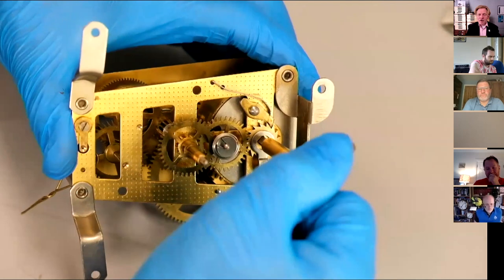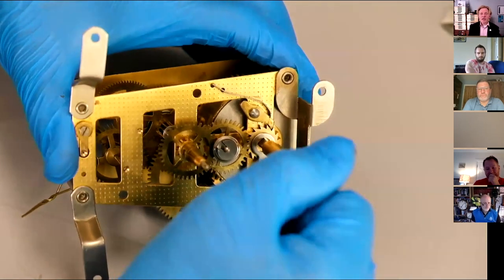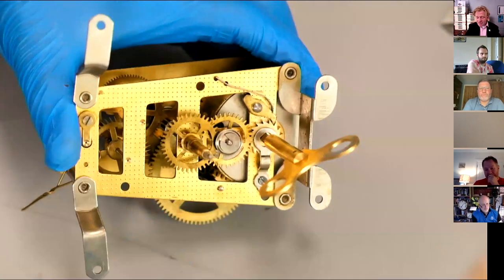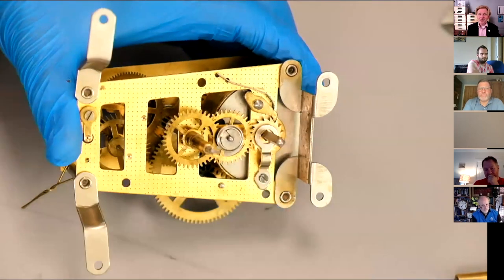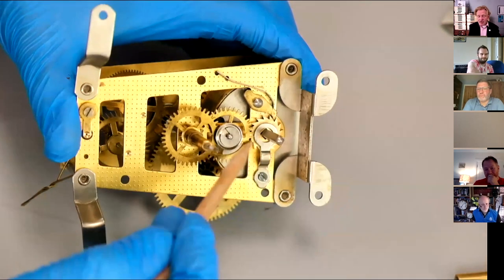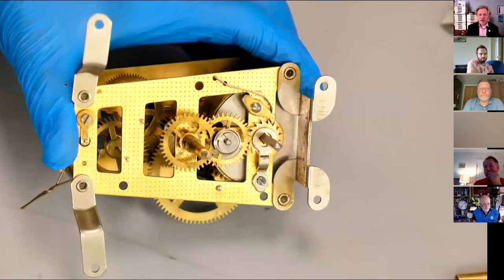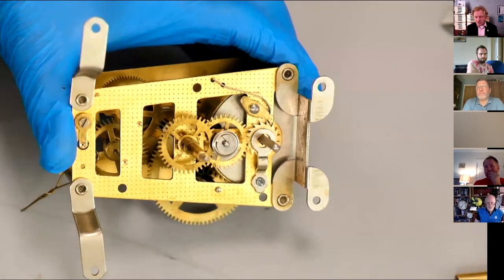So when we take our force off the key, all the stored energy in that spring is held back by this little ratchet mechanism. If you were to flick that up there, there would be kind of a mini explosion, basically. This would spin round really quickly, would probably damage this, might damage your eyes, anything could happen. So we do not want to do that yet. We must release the energy from the spring. As I say, look at the video of it.